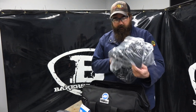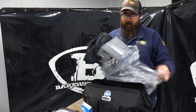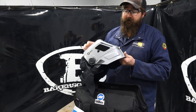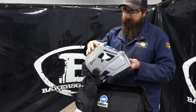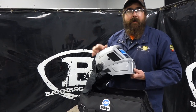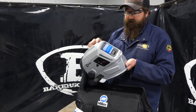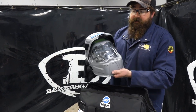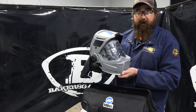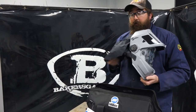And then we got our helmet here. Just at first glance, it looks like a T-94i. What's unique about these hoods — and the T-94 series are very popular hoods — they're clear and they have peripheral windows, so you get almost 180-degree viewing range. It's got the clear light technology for crystal clear vision, and on this unit it has a flip-up grinding lens. So you can go from welding, flip that up to grinding, and you don't have to take your hood off while keeping the PAPR hooked up.